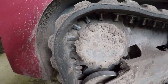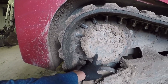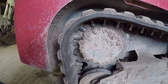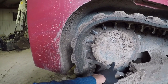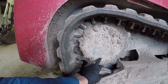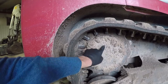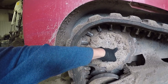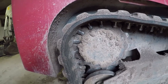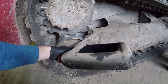Now we're gonna change the gear oil in the final drives here. Actually, the first thing we're gonna do is clean the mud off. This is something you just gotta do every 500 hours and there's three Allen-head plugs in here. This will be the one to drain it, and then you fill it in this one until it comes out of this hole right here. So we'll get it all drained out — we'll scrape it all off first, then drain it out.